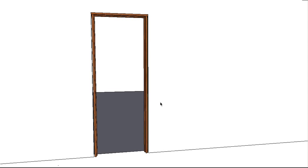And in this video today I want to show you how I go about putting the architrave around a door. Now generally when I do this I'd have the door fitted, and that way I can use the actual door to make sure the gap between the jamb and the door itself is consistent as I go. So make sure you get your door on. If you need to take it off later, that's fine, but I'd put the architrave on with the door in place.